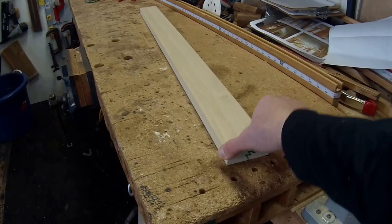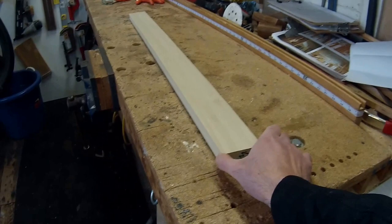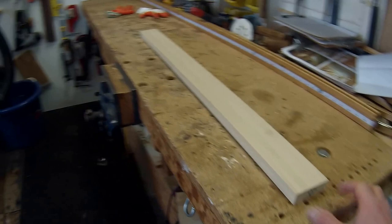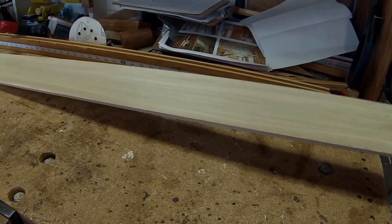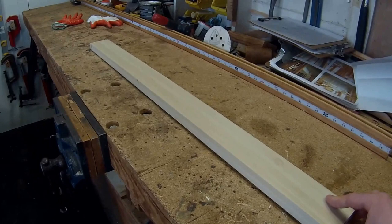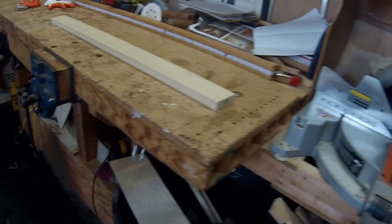You would never make a door out of this piece. But this is the kind of thing that would end up in a factory production line, because if you were going to look at this piece of wood for just two seconds, you'd say that's a pretty nice piece of wood — it's got nice straight grain, color's even, no defects in it. It wouldn't catch your eye unless you do this testing step and you can see it's not sitting flat.